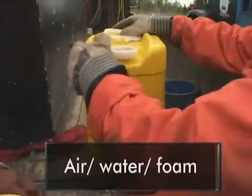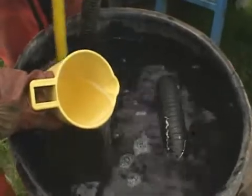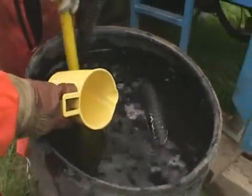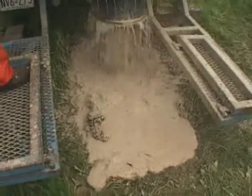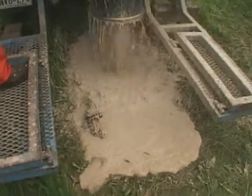Drilling foam can be added to the water, which helps fill voids and suspend the cuttings in the annular space. Operators must mix carefully to ensure foaming action occurs down the borehole as opposed to in the mixing tank. Manufacturers' guidelines and recommendations must be followed closely to ensure optimum performance and safety when using these products.